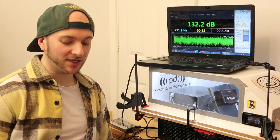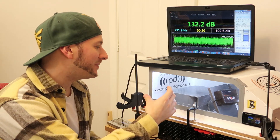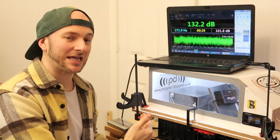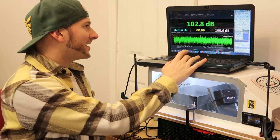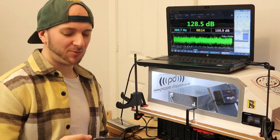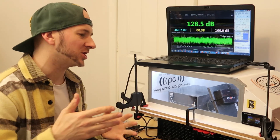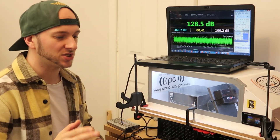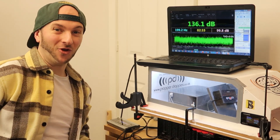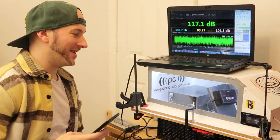So quite a bit lower at 132.2 and that is actually at one of the port modes. The positioning is so fussy because this is an extreme class cabin - literally by maybe moving the box a little bit further back or forward or twisting it by a little bit could give us another 8 dB, just because there's so many reflections in this cabin compared to a real life one. And lastly, our 60 scaled Hertz 360 - not as bad as I thought to be honest, a 128.5. With the door closed: 136.6, 136.1, 137.2, and then it drops heavily to 117.1.